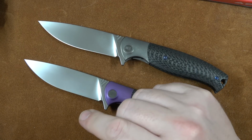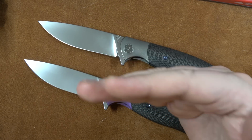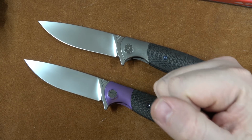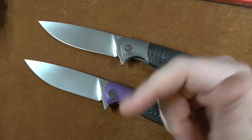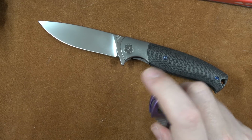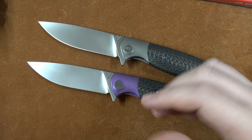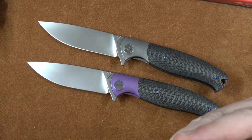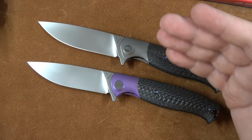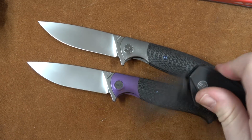We saw use of other steels because for 440C, there was a whole lot of happy and a tremendous amount of complaint about keeping knives sharp from knife enthusiasts at the time. And I'm afraid we're going to see the same thing with M390, 20CV, CTS-204P, etc. S35VN is that good, happy place where it's reasonably easy to sharpen and holds an edge for a long time. So I'm actually looking forward to WE Knife Company and some others bringing us more S35VN, and I really would implore you to consider S35VN instead of M390 in cases where you can buy the same knife in both steels, or if you're looking between a couple of knives. And yes, this is the guy that just produced a knife in M390 that is telling you these things.